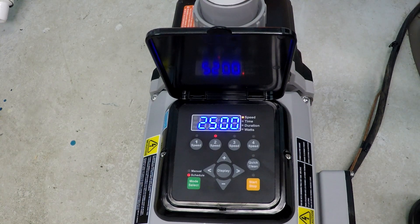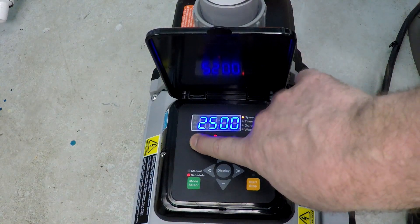We're going to be programming a Black and Decker variable speed pool pump for a 24-hour schedule that has 14 hours at 900 RPM, 6 hours at 1250 RPM, and 4 hours at 2700 RPM. We have four speed selection slots to work with, so instead of running 14 hours at 900 RPM all at once, I'm going to split it up into two seven-hour segments at 900 RPM.